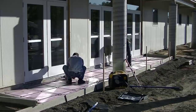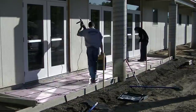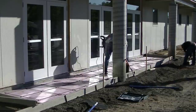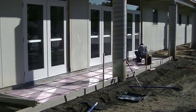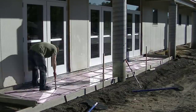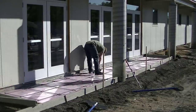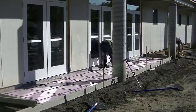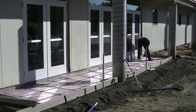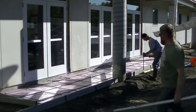I've got my hammer drill and I'm drilling into the existing floor. We're going to drill and pin this walkway to the existing floor so it doesn't move — we never want a trip edge there. That generator I'm using is really top-notch, and the Bosch hammer drill too is awesome. I'll have links for all that stuff in the description. Darren's just tapping in the pins and we're going to be ready to pour concrete. We got it drilled and pinned about every two feet — that thing's never going to heave right up against the building, it's never going to settle.